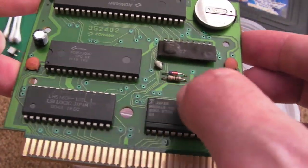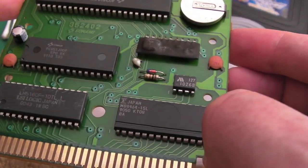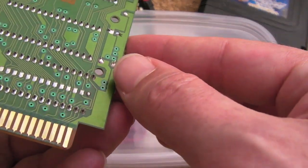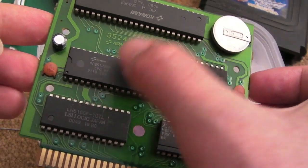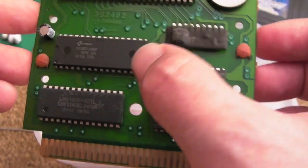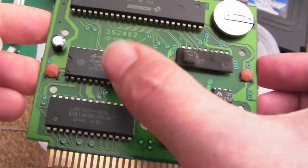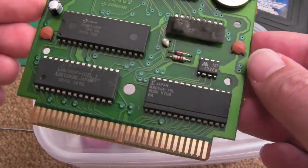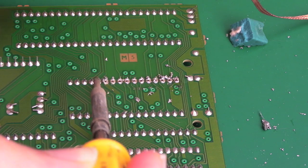It's probably not called VRAM, it's probably something else, you know, it's paging graphics and things into the RAM, I'm pretty sure. But yeah, the PCB's looking pretty clean. So I'll work out which chip it is. I think that one's probably going to be the ROM, and we'll program up a 27C040 with a translated ROM, get it on there, and hopefully it should work. Like I say, I think it's supposed to be pin compatible, so I don't think I should need to change anything there.